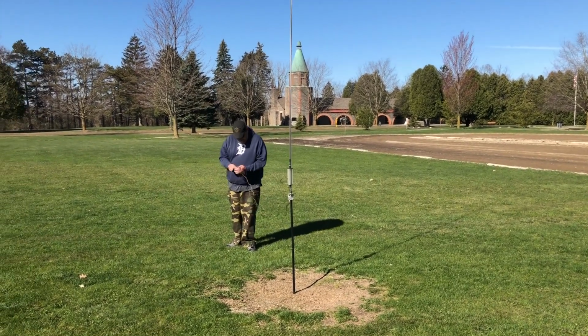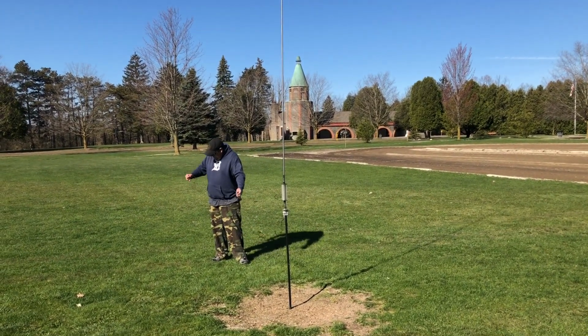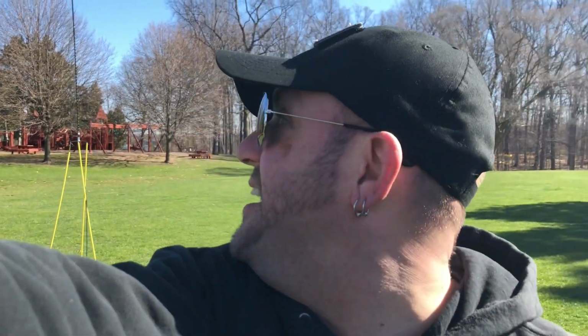All right. Well, we'll cut to some other footage when we get this done. All right. So while Jason's screwing around over there with the MFJ 40 meter, he's still trying to untangle the counterpoise wires. I got the old buddy stick going here on a tripod. I got it hooked up to the analyzer, so we're gonna see what the SWR is and see if I can start working some DX stations before he gets that antenna up.